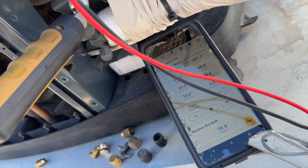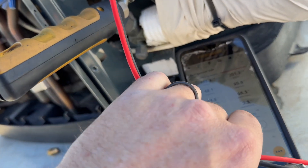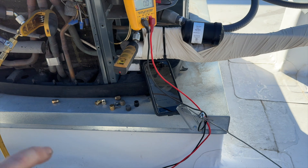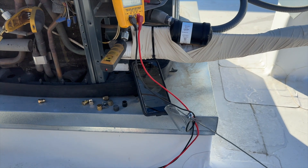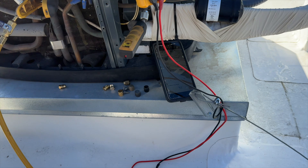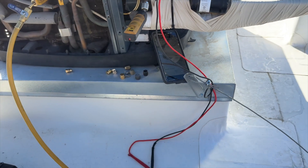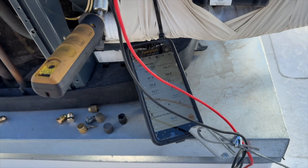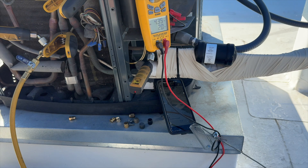My superheats are like 13 degrees. I'm going to call it good at this point — I'm just worried about overcharging it. Currently it's 53 degrees, so my liquid saturation is about 70, so it's close. This thing holds 6 pounds and I've had to add 4 pounds so far. I'm really getting close to overcharging this unit, but again it's only 53 degrees. I'm going to let it run a bit and monitor it. I'm going to go down into the fitness area and see if it's actually blowing cold air. My suction temperature is now 47 degrees, saturation is at 33 degrees, and we have low head pressure. Liquid pressure is at 198 — that's still pretty low, but this is the best we can do in this situation.